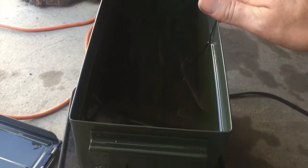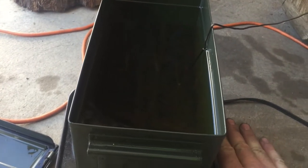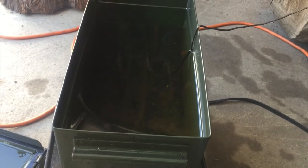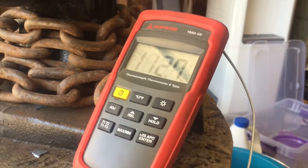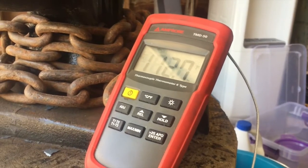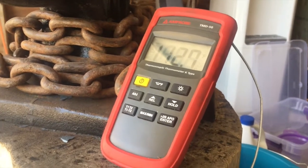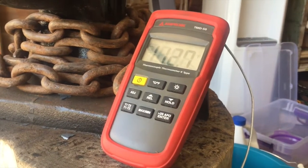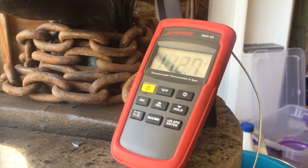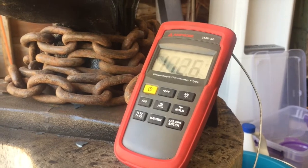What I used to do is just plunge a hot piece of steel in the oil, and what'll happen is it'll create a hot layer on top. Then down below, since the colder oil falls to the bottom, when you plunge your knife in to quench it creates different quenching speeds in the oil. To measure the temperature of the oil I have this K-type thermometer with a probe — it's really accurate and you can get them online for pretty cheap. This is indispensable; I wouldn't have the knives I have without this particular piece of equipment.